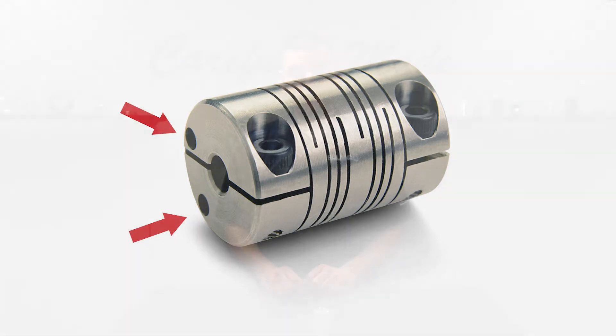It's important to know that these are not the same thing. If the customer needs a truly balanced coupling, they have to use one that's dynamically balanced. For most applications, the balanced design works just fine. In fact, most other manufacturers don't even have that as their standard design. We do here at Ruland so that we don't have to make them as specials — it's just easier for us and our manufacturing to build it right into the product to begin with.